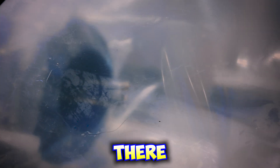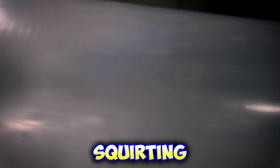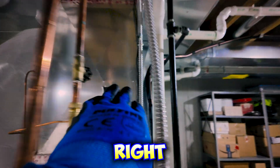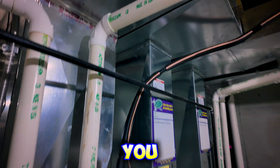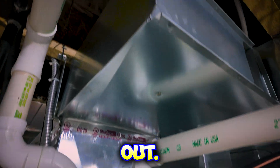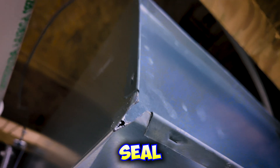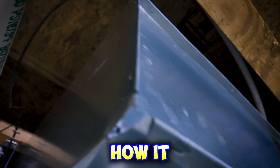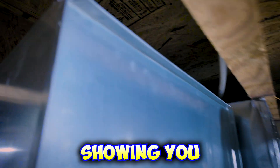If you look right here, this is called lay flat tubing. The glue is coming through — you can see it squirting through this lay flat tubing. I have it blocked off right here above the coil. And you can already see — check this out — see how that hole is already starting to seal up? That's crazy but that's how it works.